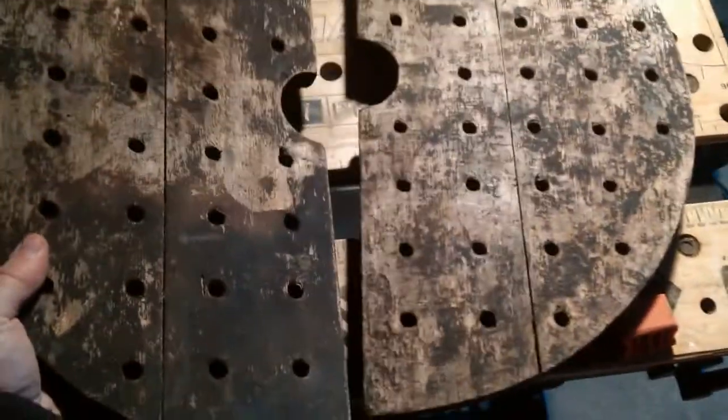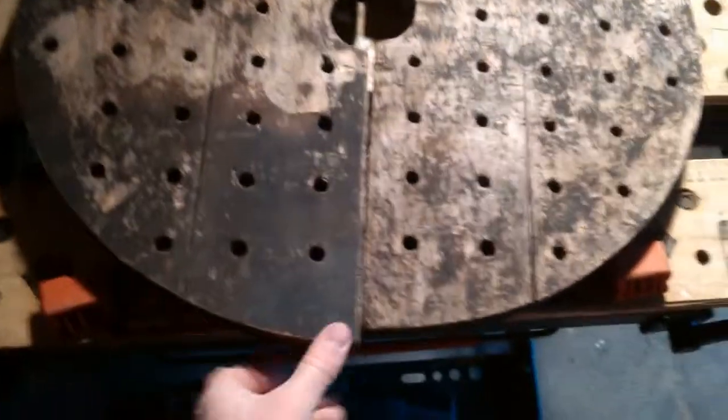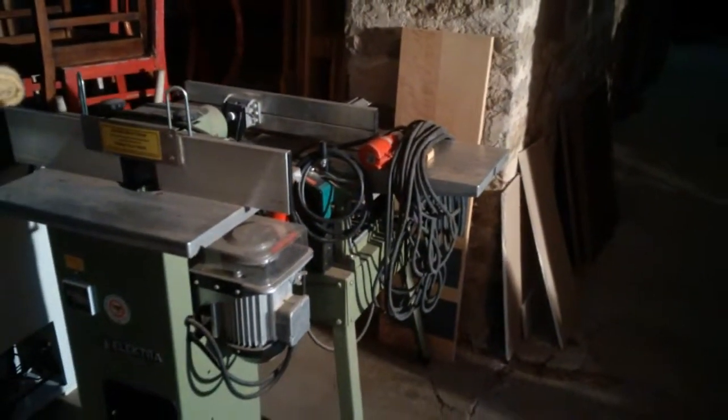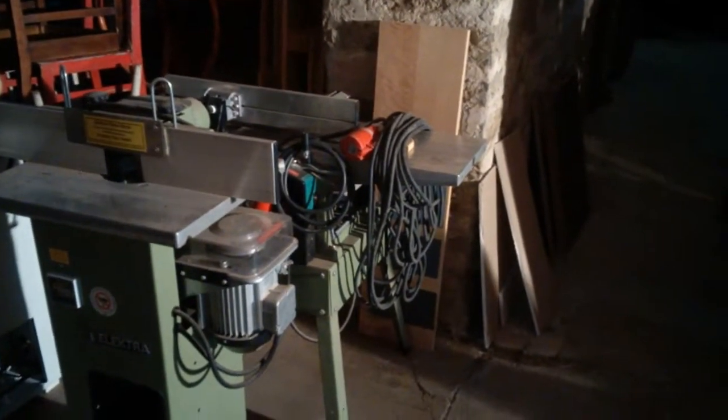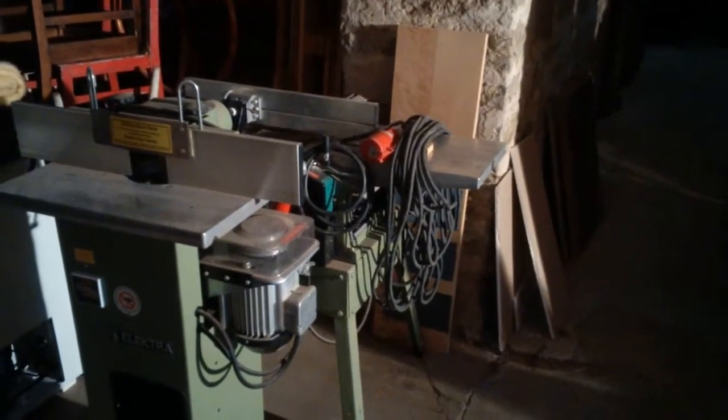Oak can stand up to a lot, but I've got floorboards which are around the same thickness, and I'm going to build a new one. I'm going to take some of the spare boards — 20 millimeter solid oak — and run them through the thicknesser to take off the top layer, because they were pre-oiled when I got them. Just take off the top millimeter so there's no more oil, then cut to size. I might just leave the tongue and groove and glue some of them together.